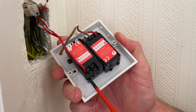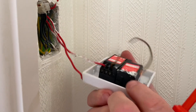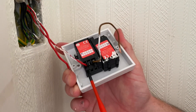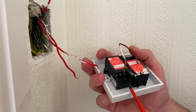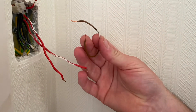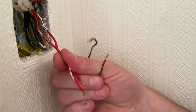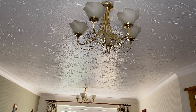Now I've got two switching conductors coming out for each of the lights — they're coming out of what would be classed as L1. I'll undo that one — that's a switching line connection — and over here we've got another one. I'll take the bridging link out as well in case I need it going forward. This dimmer has been on the wall for 15 years and I've nearly wrecked it getting it out. So there's my little bridging link.